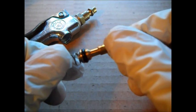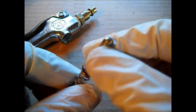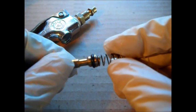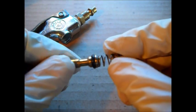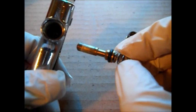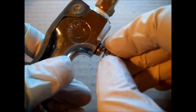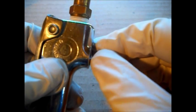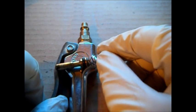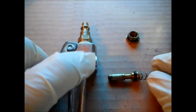Well, this morning it swelled up a little bit. They used to have a trick of putting rubbing alcohol on rubber to swell it up, in the old days working on master cylinders on cars and stuff, but it will deteriorate it. So we put the silicone on there, and when we put that in there now, it has a way better seal. I mean, it was an instant fix. This part is what goes in here, comes out here. Okay, we'll show that little seat in there again.